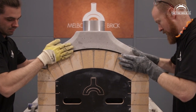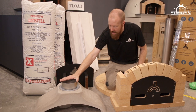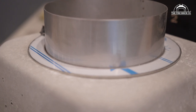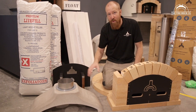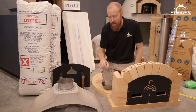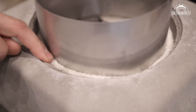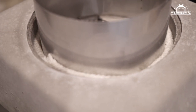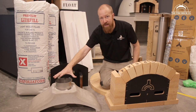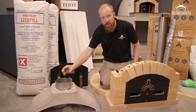The precast flue gallery has a stainless steel flue sleeve already installed in it, and there's a stainless steel ring running around it with a protective plastic film — please remove that film before you start using the oven. Hiding underneath this ring you'll see an expansion joint, which is filled with a stainless steel fiber reinforced ceramic fiber rope. The idea is that when we heat the oven, this sleeve is going to expand and contract as it heats and cools, and the ceramic fiber rope has a little bit of give which allows the flue to expand and contract without putting any undue stress into the precast flue gallery.